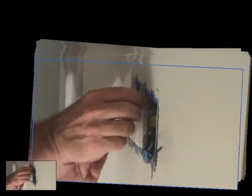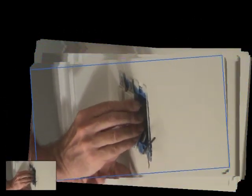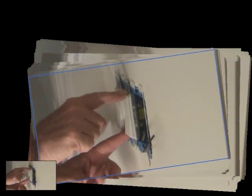At this point, I don't have this tight all the way, it's still loose. And there's a slot on the switch itself when you screw this down, a little bit of room to go left or right, which is good, because if your box isn't perfectly level, you can adjust this. So I'm just going to make this snug for right now, and then when I put my cover plate on there, I've got a little bit of wiggle room to start moving these around. So I get the first one, and then you play with that. You can adjust these, tighten them up, and it will fit perfect.